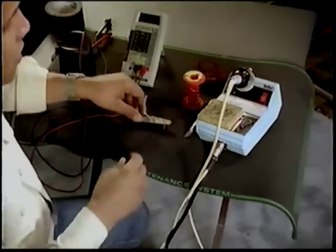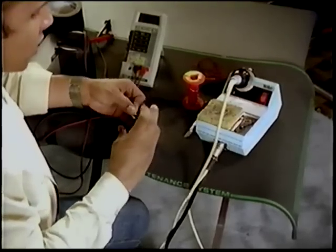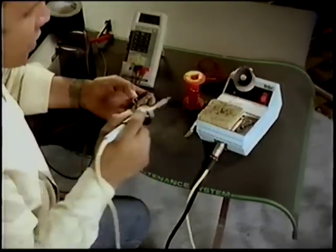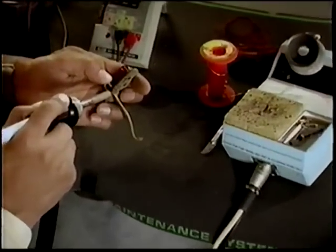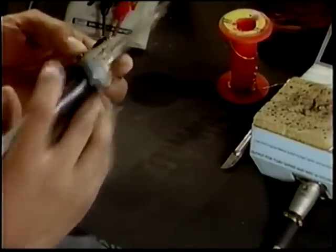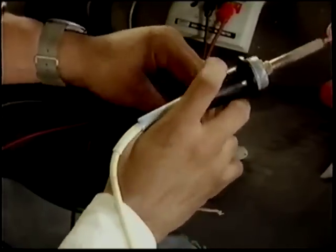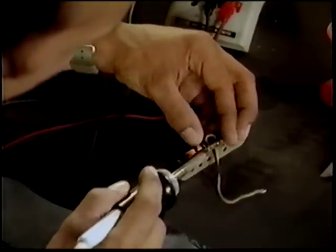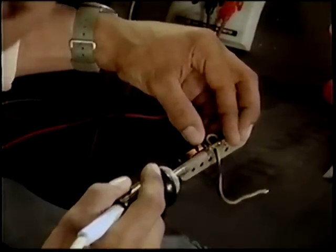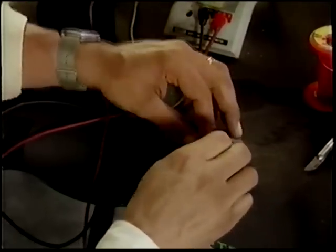You definitely don't want much more than 6,000 ohms on your Fender type pickups, if you really like to preserve that Fender sound. And it's really helpful to make a diagram on which color wire went where. Okay, we made our connections. We'll test again.